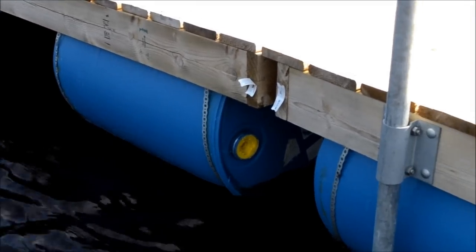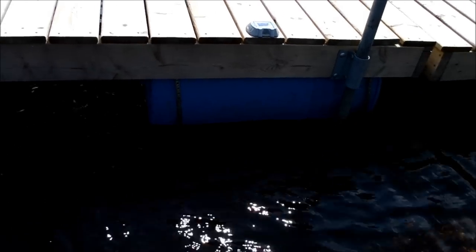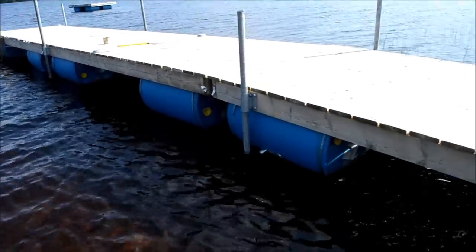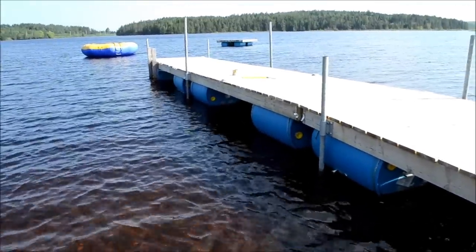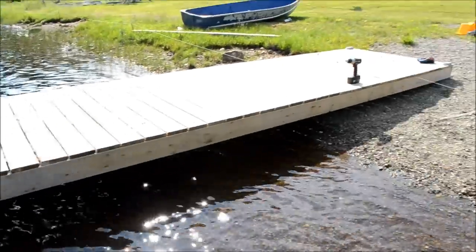Once you put the platform on, it sits in between each section. Recall I mentioned there's a 2x6 running up through the center — you can see back here there's a barrel there, and a barrel there. For each 12-foot section we have four barrels, and that seems to work well. The five-foot width works wonderfully — two adults can walk past one another on the wharf with plenty of room. Four feet would have been a little narrow and more dangerous if the wharf sees a lot of activity, which this one does.